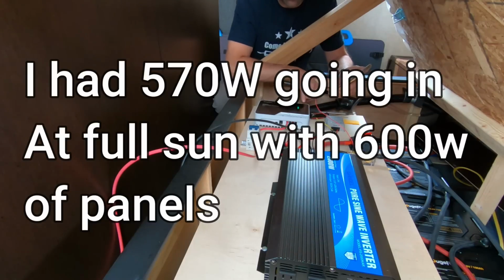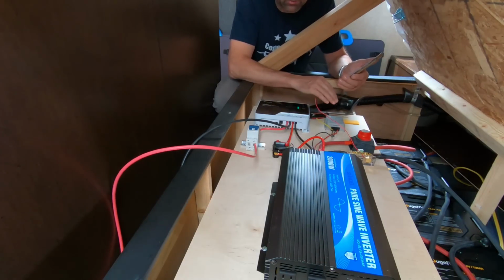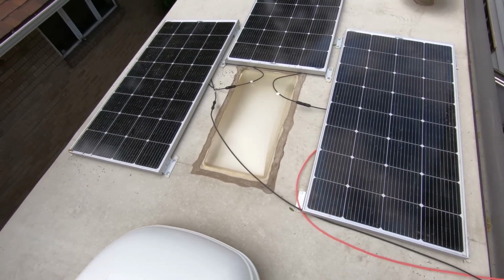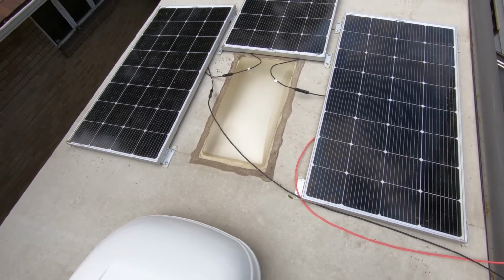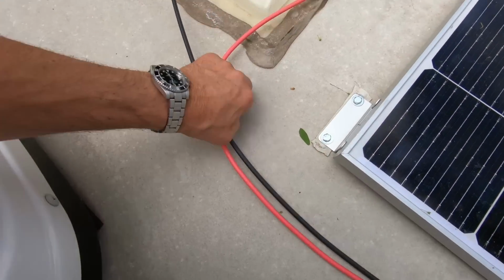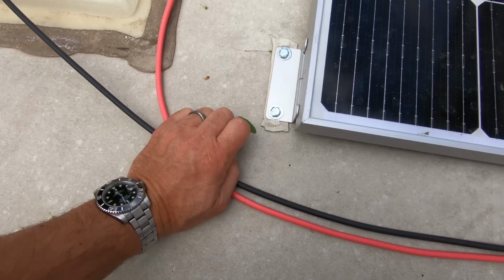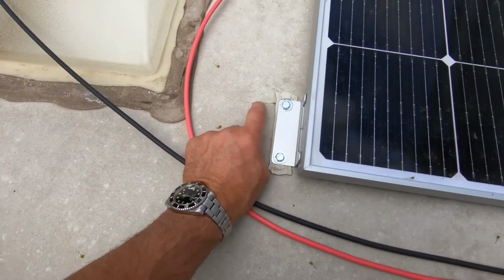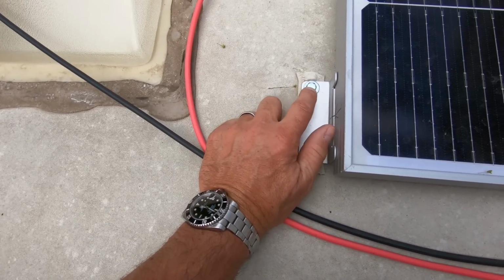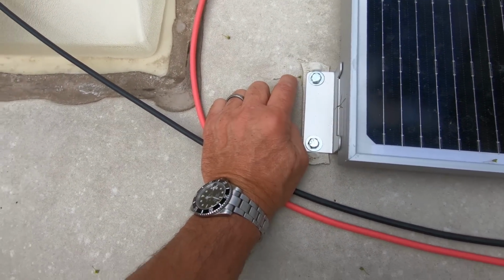Now this MPPT charge controller will move up and down to find the right amount of electricity to put into those batteries. Here's the solar panel setup. 2S4P, 2 in series. I'll show you how I've got them mounted here. This is just temporary with these. These are going to go down the refrigerator. This is butyl tape that is underneath the brackets. You can see I made this line here. This is the roof rafter. These are 2-inch, 1/4-inch lag bolts that go right into the roof rafter.